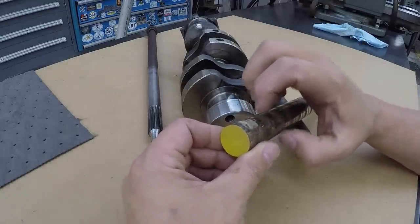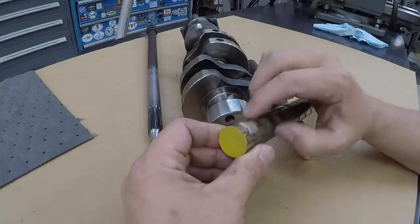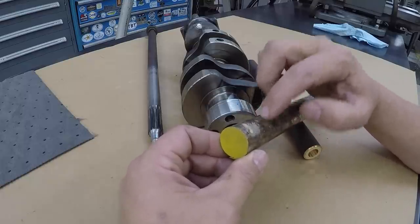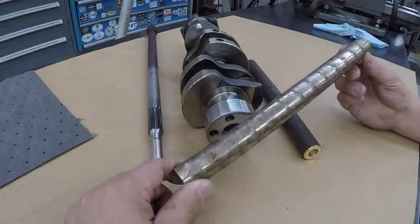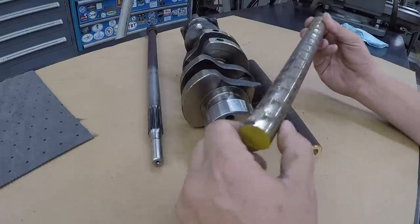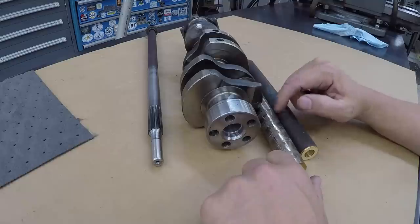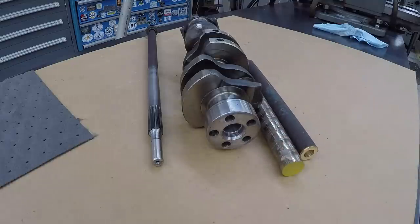They've actually got bushings already made in sizes that you can purchase, but I've got to make one. The small bushing that I could have bought, to just machine the OD and then the ID and then part it off, was half the cost of getting a whole piece of bar stock. So I just bought a 1 foot length of it. That way I can make this bushing, and I've got more stock on the shelf for later projects. So we're going to go to the lathe and machine the bushing out of the oil impregnated bronze.